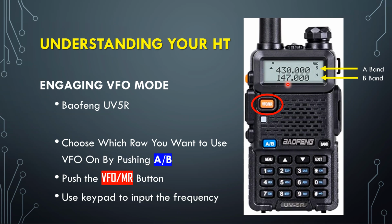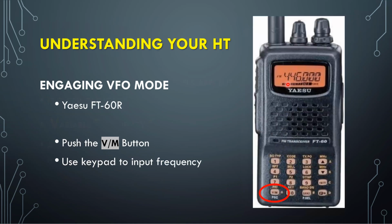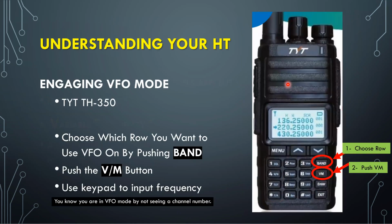We're going to get to the output frequency later on. Yes, Jan. One thing to think about is that you have almost two radios in one box, right? One is the A radio and one is the B radio, so you can decide which one you want to use. On this one, the little arrow on the far left is pointing at that middle one, so that's the active one. If you were to transmit, that's the one that would be transmitting. But it can actually receive on all of them at the same time.